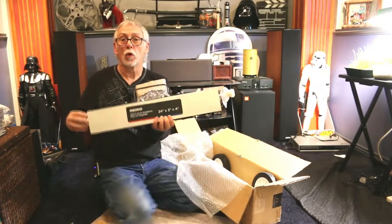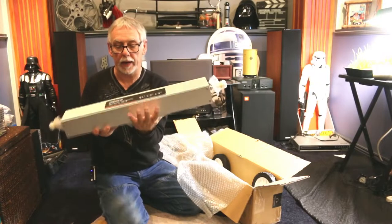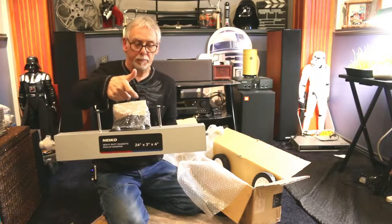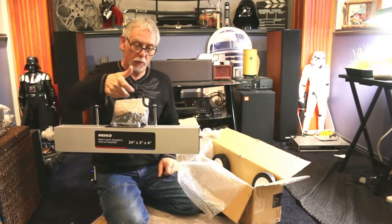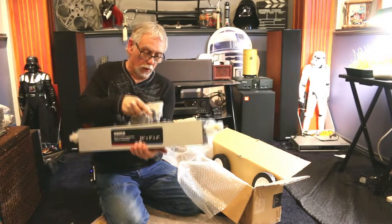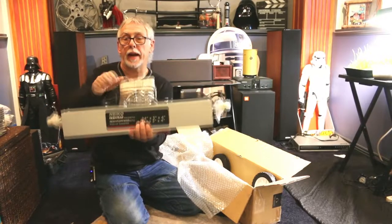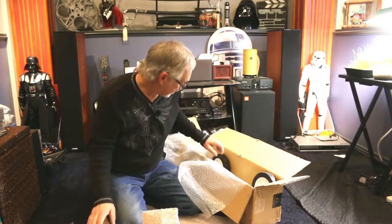Once you do roll over this, I don't know if you know that or not, you pick up a bunch of nails on the bottom. When you pick this up like this, it pulls the magnet towards the top, and everything that was on the bottom drops down. So once you do pick up all your nails, don't think that this is a carry handle, because you'll lose everything you picked up.